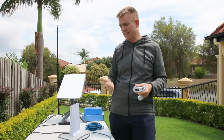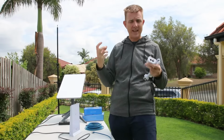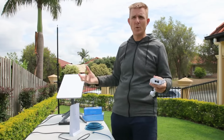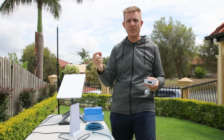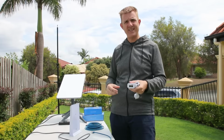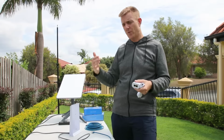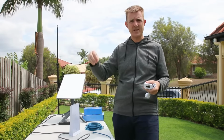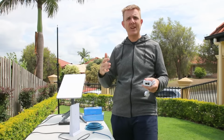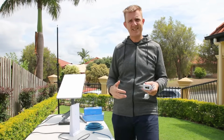Now, factors that affect that are the quality of antenna. So if you're in your property and you've got smart light bulbs, those type of things, that will make a big difference. In my house, I've got maybe 40 downlights. That's 40 devices wanting to connect. So I probably want more access points closer to those than trying to find more powerful ones. All right, the makeup of the wall. This building here has got Besser brick filled with concrete. You're going to at least halve your speed through each wall that you go through, and that's maybe a good rule of thumb to take as well.